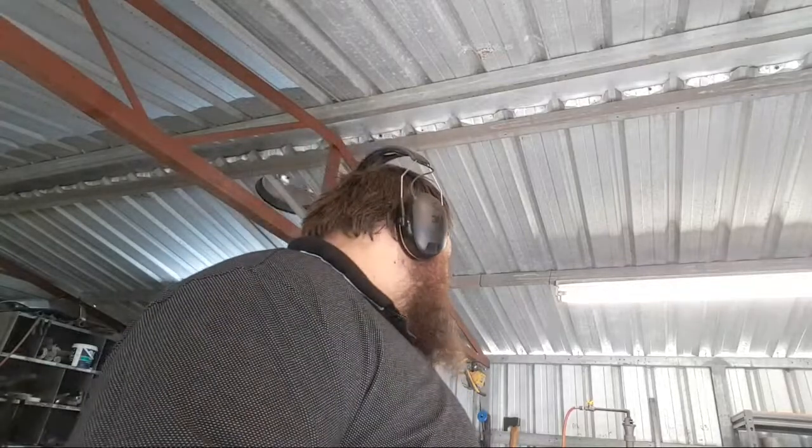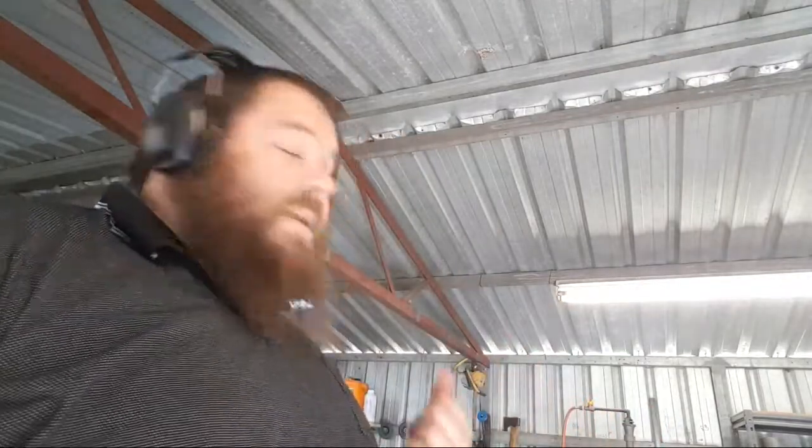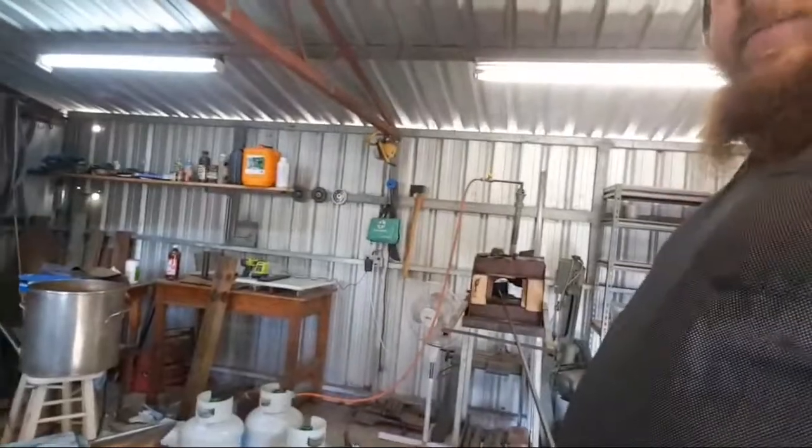Promise. So we've got some 12mm square. The tongs I'm making aren't for heavy duty, they're for pickup. I actually call them fetch tongs because I make the reins 20 inches long. They're designed for going into really hot forges where I want to get right in the back to get something. They're really good as pickup tongs as well. I made a set ages ago and unfortunately I made the boss just a little bit too thin and it sheared off, so we'll be trying not to make the same mistake today. So we'll do the lighting of the forge ceremony.